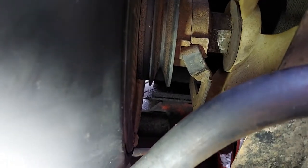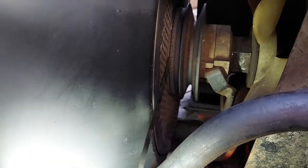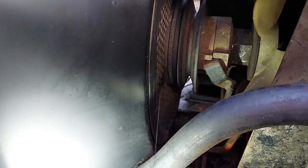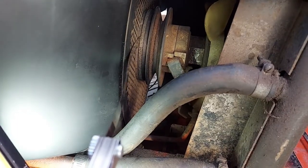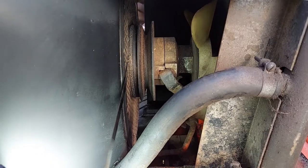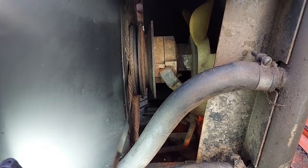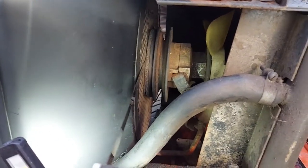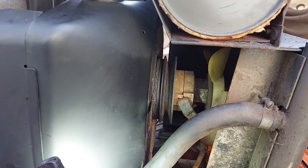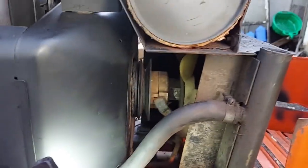Handle's all the way back — it looks pretty good. Most of the time we just do this by eye. The eight-thousandths gauge goes in and it's dragging a little bit, which means it's probably pretty close. You want to do the same thing and put the other feeler gauge on the other side — 180 degrees apart. The other side is a bit tighter; chances are the bearings and clutch disc are a little worn or slightly crooked. Spin the pulley around and check — with both gauges in, it drags a little but it's probably close enough.